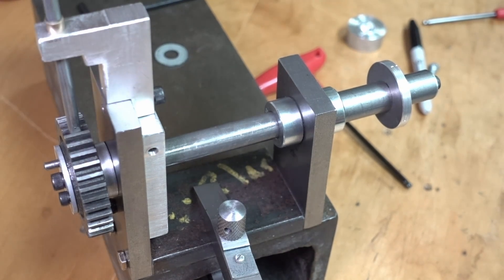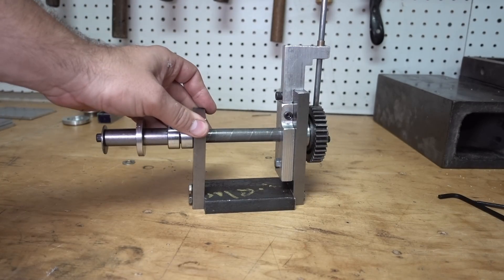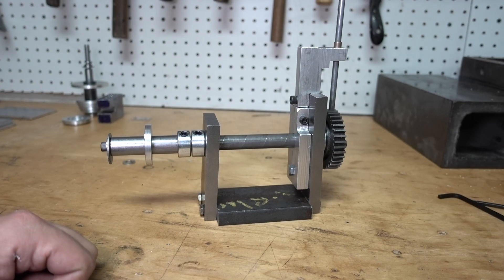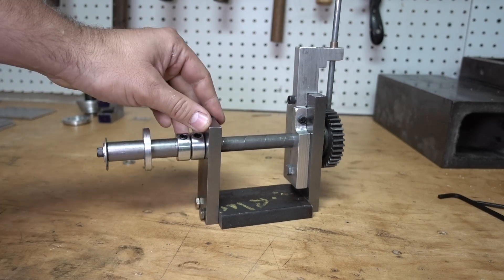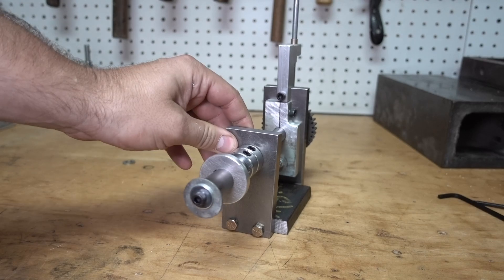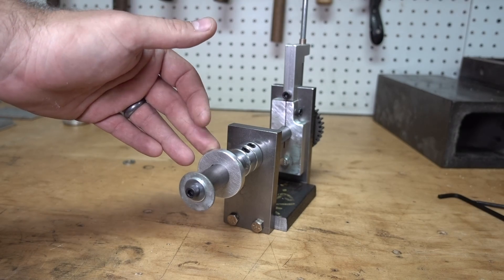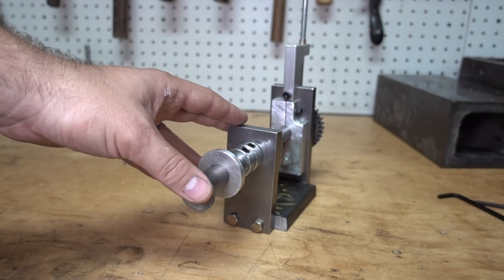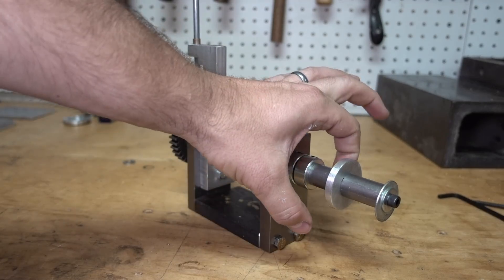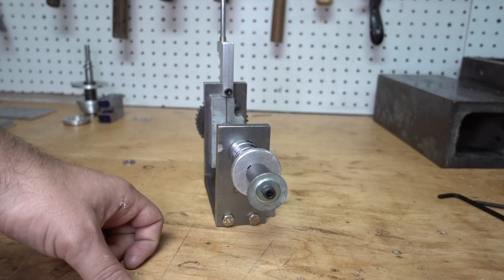This was really easy to make — I just made it out of junk material I had sitting around: some cold roll, some aluminum, some hot rolled. That's why I didn't do a build video per se, and plus this is pretty specific to what I want to do. I'm making gears that have a 5/8 bore. You could scale this thing to really whatever you wanted, or have a larger diameter shaft and turn a thread so you could put a three-jaw or four-jaw chuck on there.